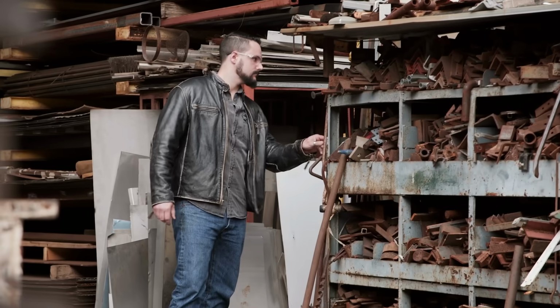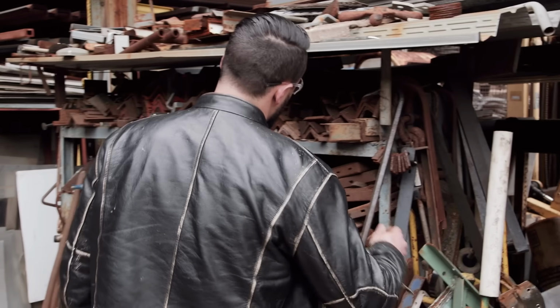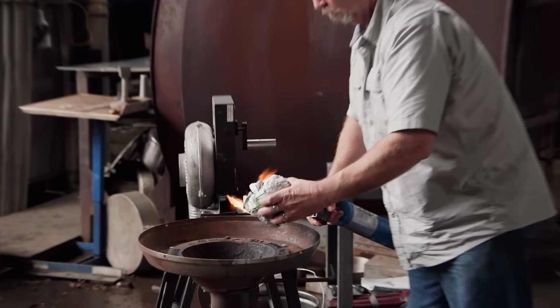Picking a metal is going to represent a little bit of a challenge because some of the steel could have had a really rough history, which could include microfractures. You don't see these things, but they can reveal themselves whenever you do the heat treat. Michael's got a pry bar. Is that going to be a high carbon content? It depends. We've had some that were really good. We've had some that were sketchy.